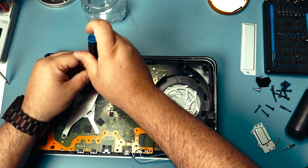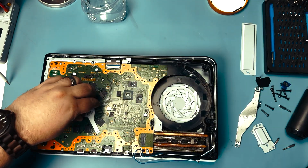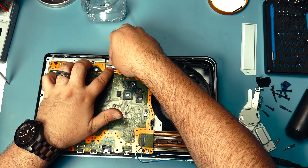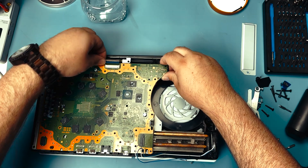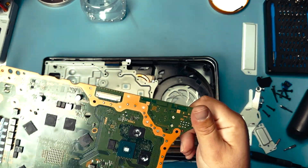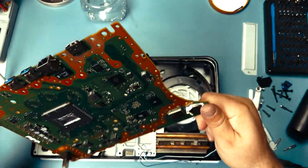Let's get this board out. Hopefully they didn't pull any of the pads for the HDMI, but if they did we can go through how to fix them. There's a screw on the board here and over here as well. Push down on the bracket to slide out the big flex cable, then pop out the board and lift it out. Under the microscope it looks like we're missing a capacitor.